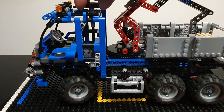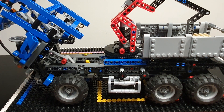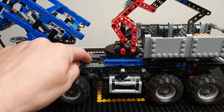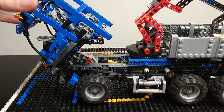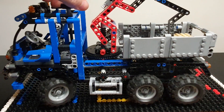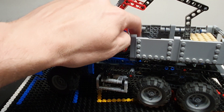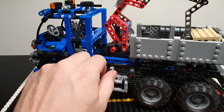It has the hand of God steering up here, also with a tilting cab. That's nice and easy to operate because it has this knobbly gear which meshes into the bottom one, so there's no problem with disconnecting it and lining it back up when it's ready to go. For the boom, we wind this one here, and it has the very old-style crown-type gear operated by the worm screw to raise up the boom.